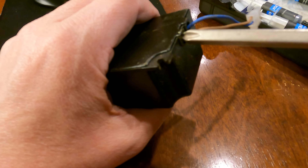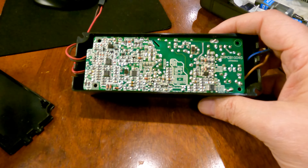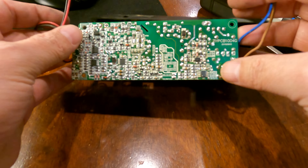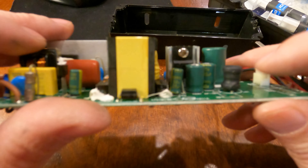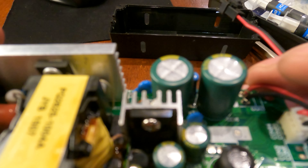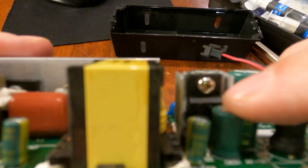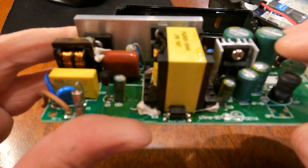The back case of this controller just pops on. Now we're into it - I bet anything it's a capacitor. That's pretty much anything I know how to fix on these. Let's pop it open and look at our caps. Flipping it over I can tell right away it's these two little caps. The way you tell if a capacitor is blown is by looking at the top - where the plus is, it's not perfectly flat, it's a little bit swollen. That's a relief valve on the capacitor. All the other capacitors look fine.